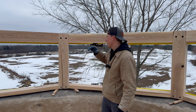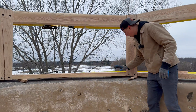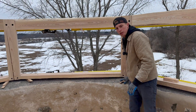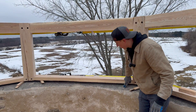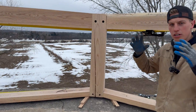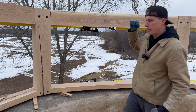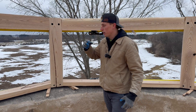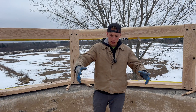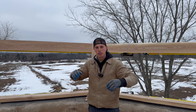It got a little late on us last night, but we did get the lower portion of this roof all assembled. As you can see, we got a lot of shimming going on, and that's because our cap on the silo has a big pitch inward. We shimmed it temporarily but we'll fill this all with mortar when it gets warmer out. We didn't dowel or anchor it down at all yet — we're going to assemble the entire roof and then do that last, in case we need to tweak it. Next step is getting the lift out, finishing the upper portion of the roof — we'll get scaffolding in the middle, set up the keystone beam, and start setting the rafters.